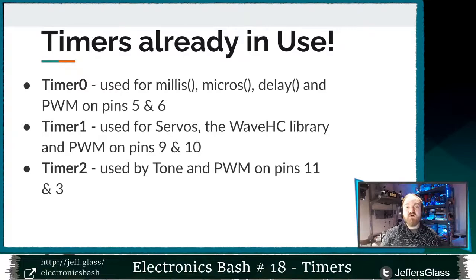The servo library is generating a pulse every few milliseconds that's a certain width wide. Think back to our servo example: the way a little hobby servo motor is controlled is that if it's receiving a regular series of pulses, if the pulses are wide, we're rotated all the way one way. If the pulses are narrow, we're rotated all the way the other way. Well, that's a perfect task for one of these timers, right? You configure your OCR register to be on the lower end, and have your bits automatically turn on and off so that the pulses get narrower. Or maybe I adjust my value to be on the higher end of my timer and my pulses are longer, and so on.